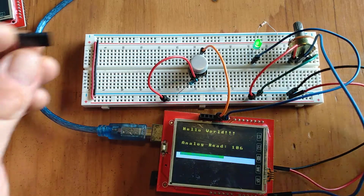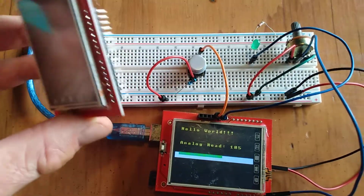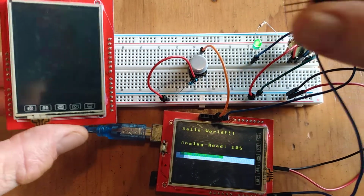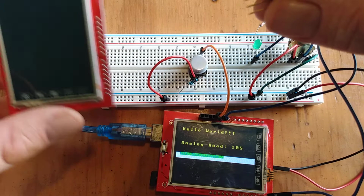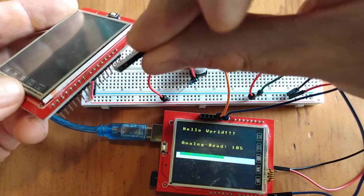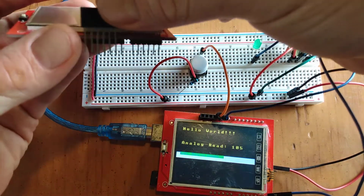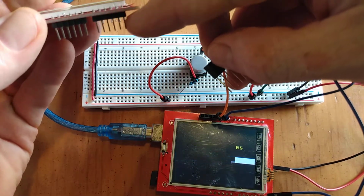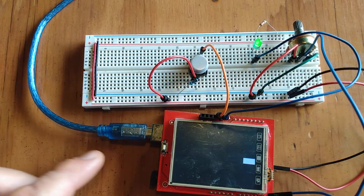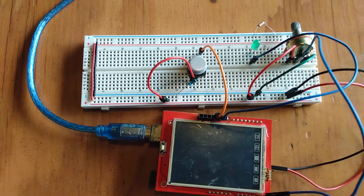And it does require the soldering tools. These boards are really cheap, and actually it's like three times more for the ones that don't plug directly in the Uno. So for a third of the cost, you can buy one of these, grab the soldering tools, and just replace those last six pins with a header like this. Probably wouldn't hurt to do the same thing over here. And pin A5, you can also get access to. So then you have some input outputs for regular microcontroller projects and a really nice display for it.